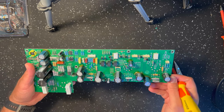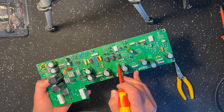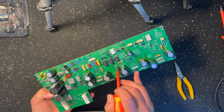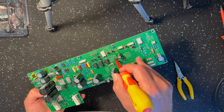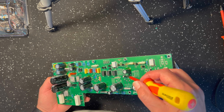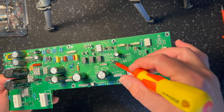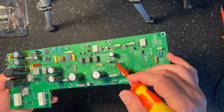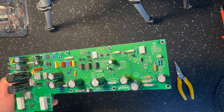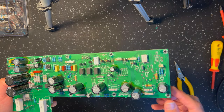I did, of course, forget a few things. I've just taken them out now. So these three resistors here, 52, 51, and 53, they've all come out. C50, that's come out. And R54, I think it is, this resistor right on top of V2. You've got to remove it from the top. You can't get to it from the bottom. I think that's us now. I'm going to start now putting the new components in the new layout.